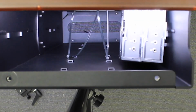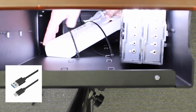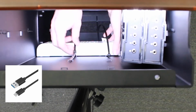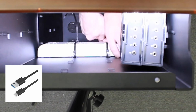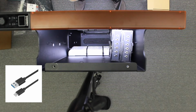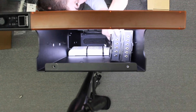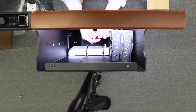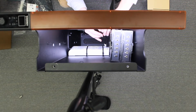With the power strips we have 8 ports and 4 USB slots. 2 of those USB slots are dedicated to the 2 Esper boxes to supply power to them. The Esper boxes come with a USB-C to USB end, and that USB is going to plug into one of the 2 that are needed for the Esper boxes. And then the actual power strip has 8 ports. 7 of those are going to be used for the camera power supplies, and one of them is going to be power supply to the USB hub, which I'm going to mount on the right side of the booth using the top mounting position in a second here.